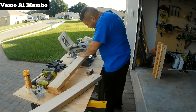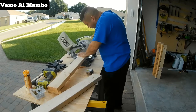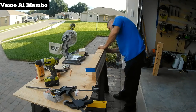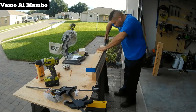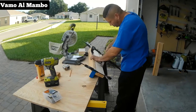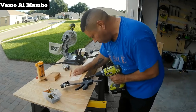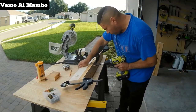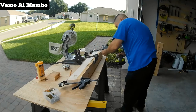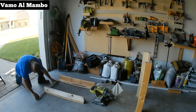We are starting our build cutting eight pieces of two by fours at 31 inches each. We are going to use carpenter glue to create a stronger bond, then clamp them down making sure that everything is squared. I'm using three inch exterior screws from Pro and no pre-drilling is necessary. You're going to have to do this four times because we have four legs in our bench.